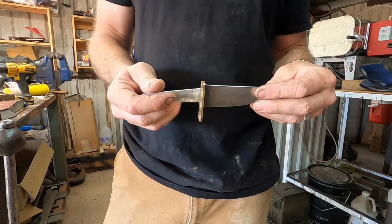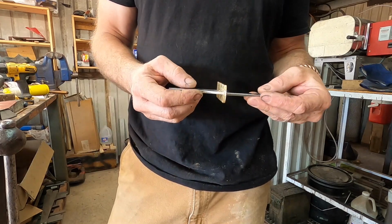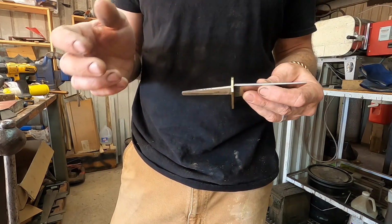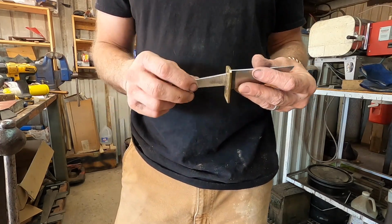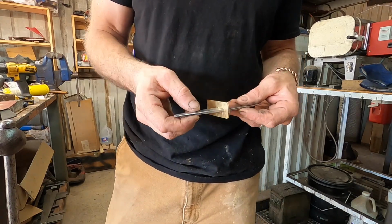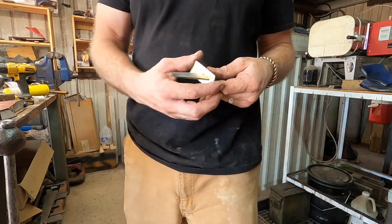All right, high carbon, high alloy, a significant level of hardening just in still air compared to most steels. Not going to be able to drill through this, but I want to see if I can spheroidize it, anneal it sufficiently to be able to do that. I don't think I can, but I'm going to give it a shot.